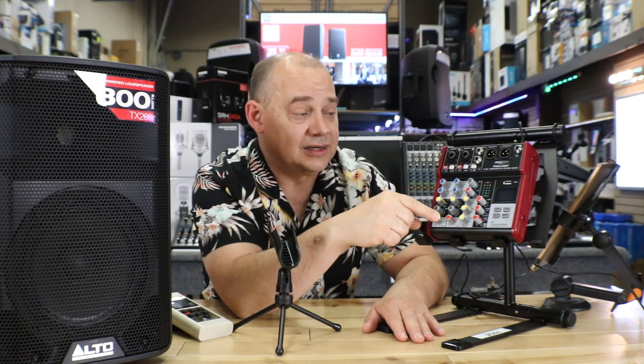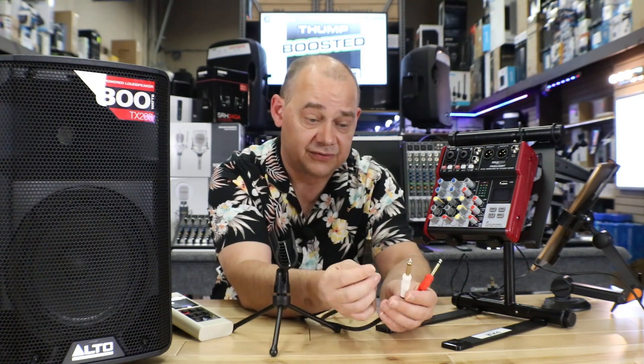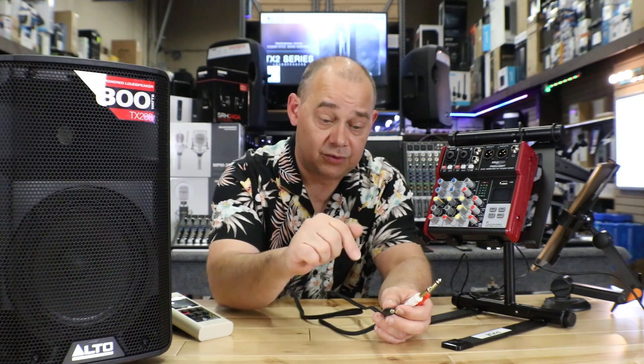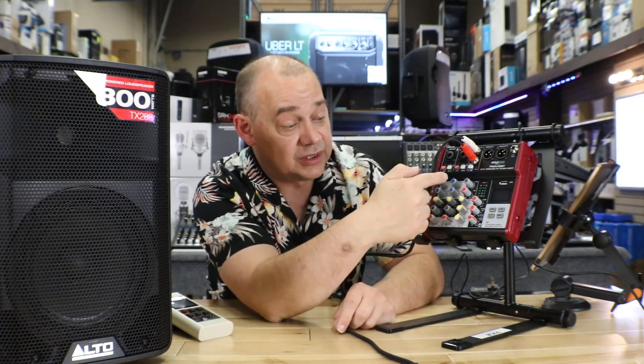Normally a lot of mixers do have audio interface capability, but this one is not built that way — it's built for recording. So if you do plan on recording on it, first you've got to follow the instructions from the beginning of this Q&A session. You have to take your music and bring it in via line three and four. Just use a quarter inch to a 3.5 adapter kit — it's going to have two quarter inch at one end and a 3.5. You want to plug that in here, plug this into your tablet or laptop, whatever you want to play your music from, and gain control it into channel three and four. Once you've done that, put in the actual USB stick, choose record and record. Remember to follow all the instructions to adjust the gain levels. That's how you can record on this if you want an end product you can play around with on your computer.